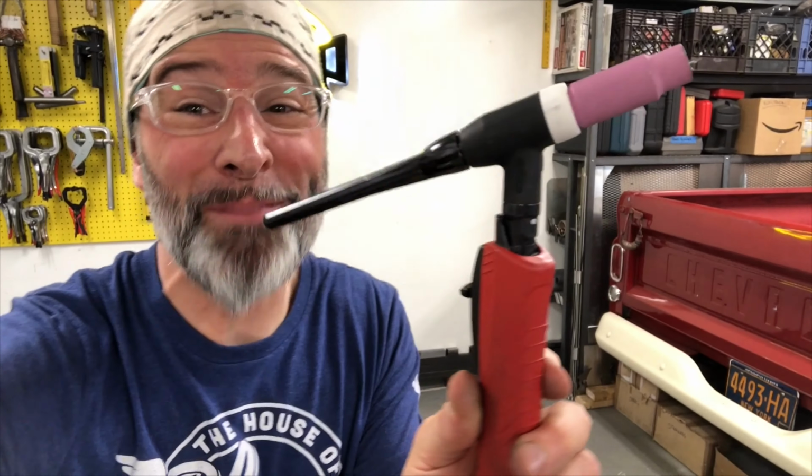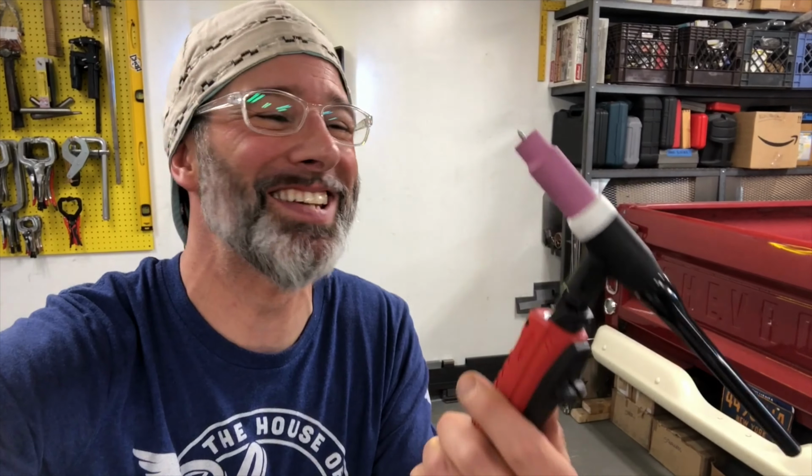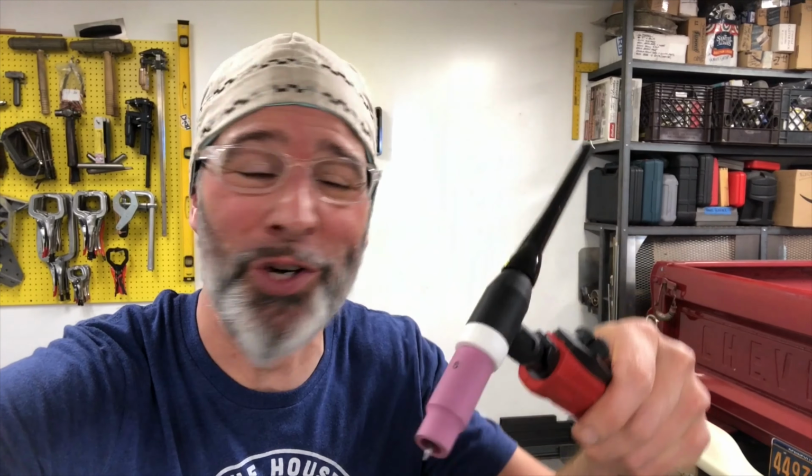Before we weld the top caps on, let's talk settings, because I always forget to do it, then someone hits the comment section and asks. All the sheet metal parts that were welded to the tubing were done at 75 amps, one pulse per second, with a 30 base and a 30 duty cycle.